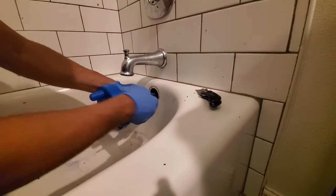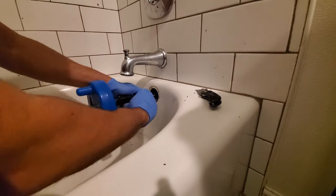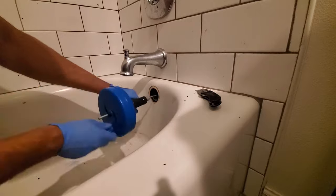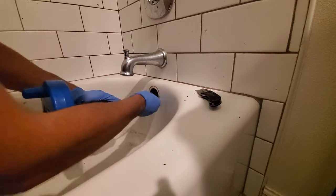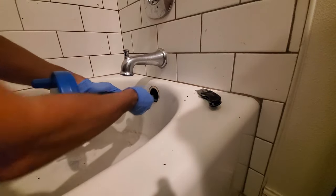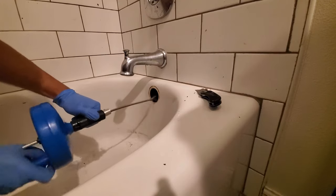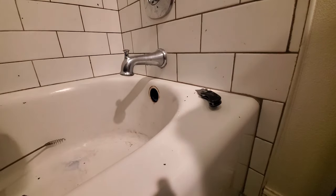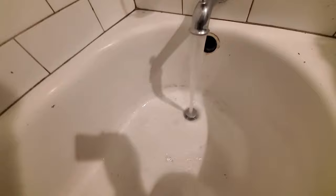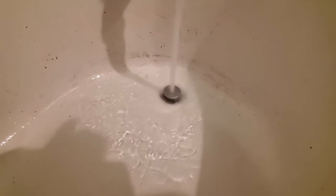It's clearing pretty good. We're going to unlock it and feed a little bit more. Usually I get one or two big pulls of hair and goop before the drain is free. Did you hear that? Now it's going all the way in — sounds like it's free to me. So we're going to unlock it and start pulling it back. I don't see that much on there; I might have just pushed the remainder through down the pipe, but I really feel like the drain is clear. Moment of truth — turn on the water. And it looks like it is draining. Clog cleared successfully.